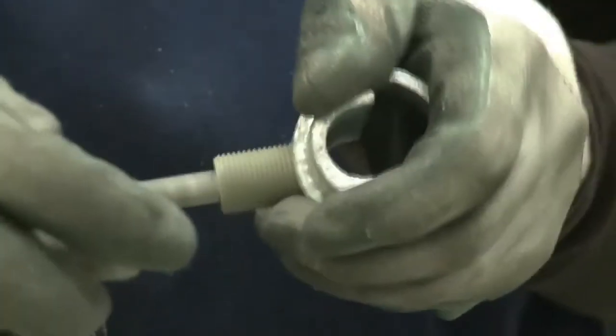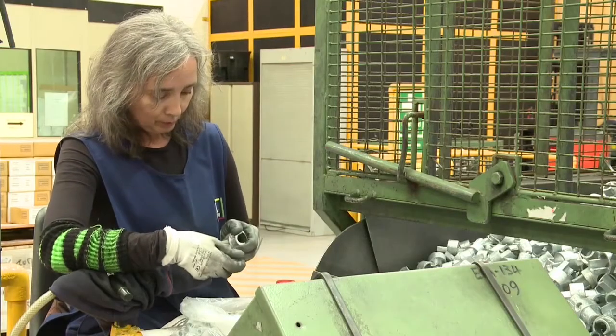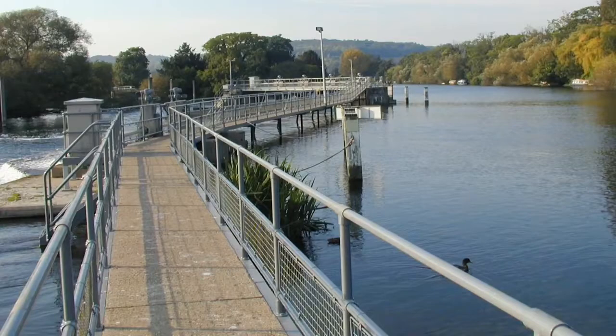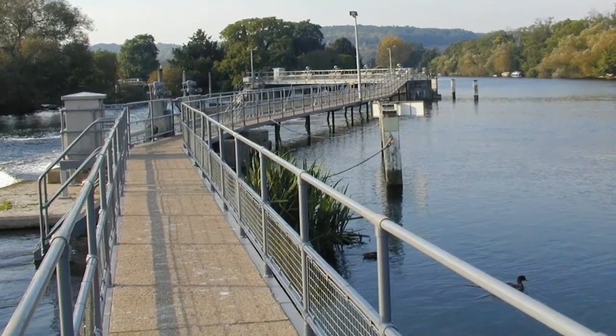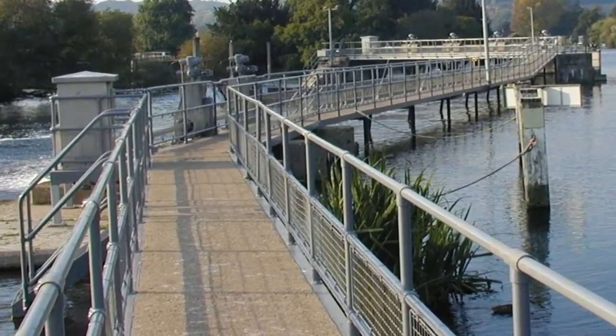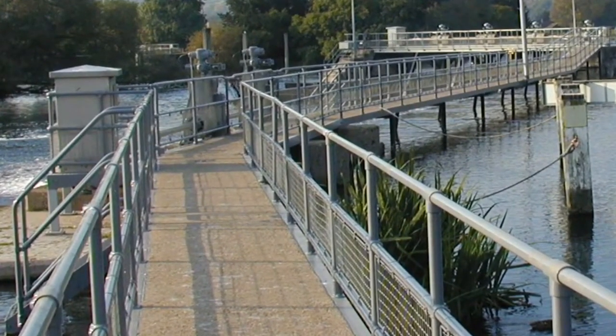This means that the average life of a structure using corrosion resistant hot dip galvanised KEE Clamp fittings will be 37 years in a Category 3 town such as Newcastle upon Tyne. This compares very favourably to the 4.7 year lifespan of a fabricated untreated steel structure. KEE Clamp fittings do away with the need for any bending or welding of tube on site. It simply needs to be cut to size. This dramatically reduces labour costs, resulting in added long-term value to the client.